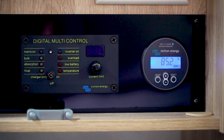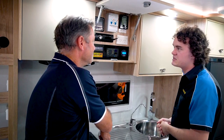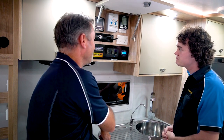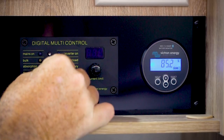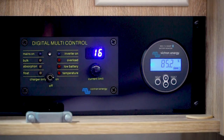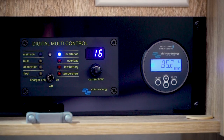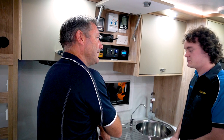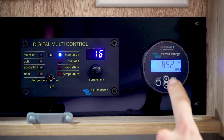That's with all the lights the Willow has around the place. Come down further and we've got the state of charge — that says we're at 85.2 percent. Obviously we're in a shed at the moment with all those lights running, but this will run for ages running every single light in this setup. So our customers don't have to go and get under the bed to do anything. Once fitted up, all they have to do is come in, turn this on, and their 240-volt power points will be active. If they've got the Victron 3000 setup they can also run the AC.